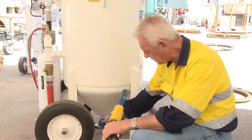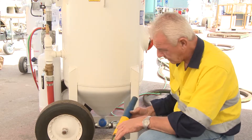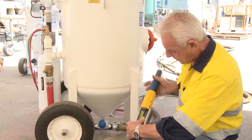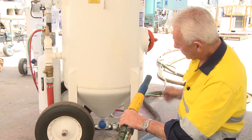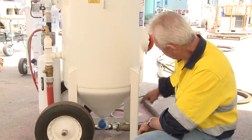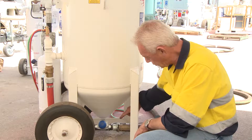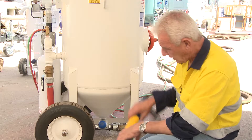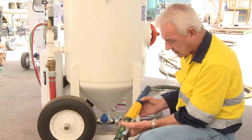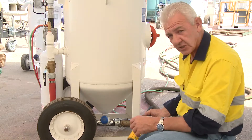With the valve wound all the way in and you open the dead man, it'll scream. However, if you release the dead man and wind it counterclockwise three and a half to four turns, depress the pin, and open the dead man, the grit will start to slowly come out of the end of the nozzle. I say slowly because in this flow there's a length of hose — normally 15 metres or 50 foot — so that grit has to join the airstream and travel all the way out. Once there is grit laying in the line, each time you depress the dead man the grit isn't far behind it. Be patient and just wait for the grit to come out.